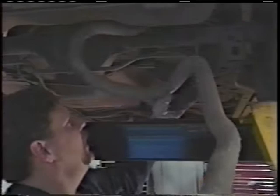One thing we talked about when we ran this vehicle in is that we wanted to make sure that the rear wheels were at the rear cross section on the post. There's a reason for that. If you did not run that vehicle there, you would not be able to get this tailpipe out. It would hit this cross beam and you wouldn't get it out. Being as we've centered that now over that cross beam, we can take this tailpipe right out of the vehicle and we're able to discard that and put the new one in when we're ready.